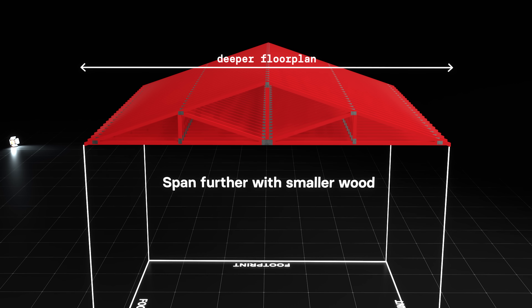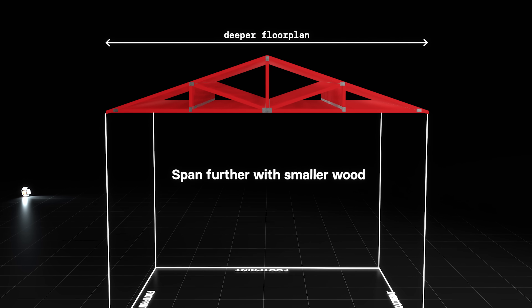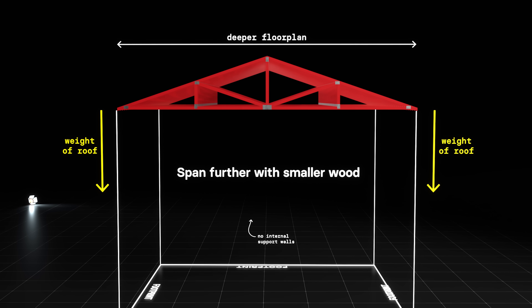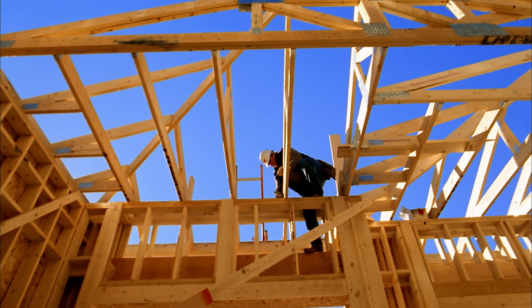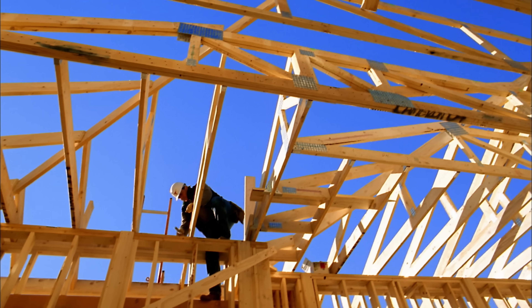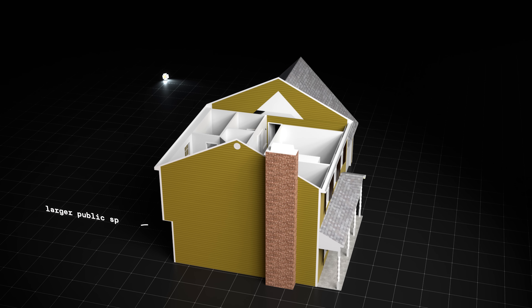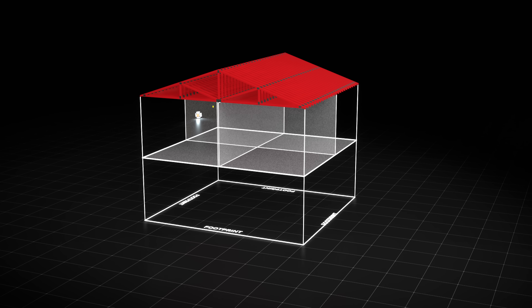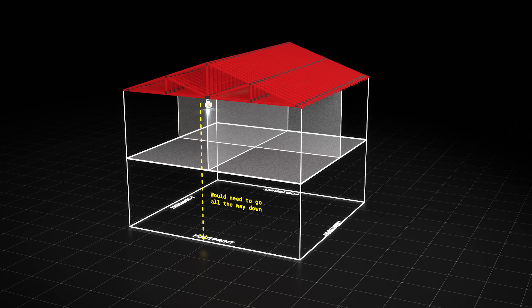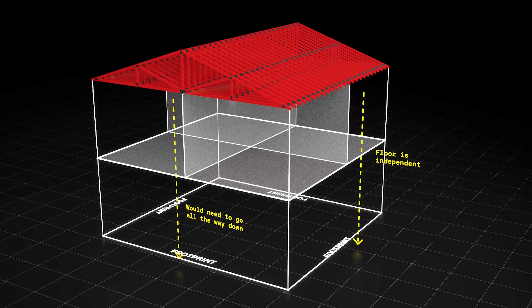Another feature is that you can have a deeper floor plan without the need for multiple roof slopes, because the truss can span further with smaller pieces of wood. The higher strength-to-weight ratio also means it can span the entire width of the house without the need for any internal support walls — all the weight of the roof is carried down through the outer walls. Since these exterior walls carry the majority of the load, they might be built with larger wood members, maybe 2x6s instead of standard 2x4s, giving more space for insulation. Meanwhile, there are no interior walls bearing the weight of the roof, so the first floor can be completely open while the second has lots of walls in it.